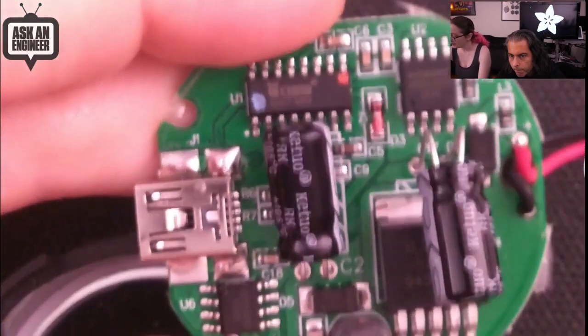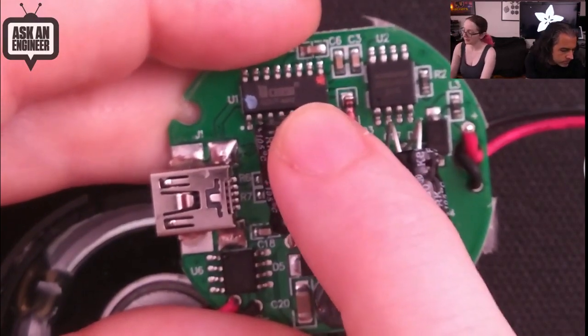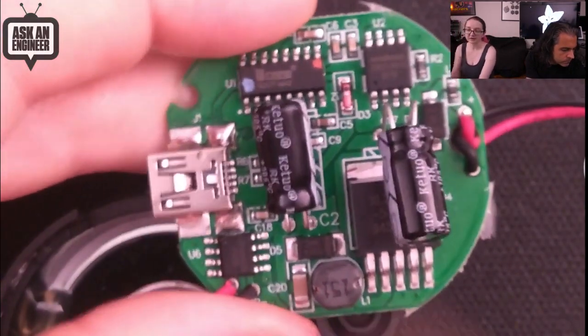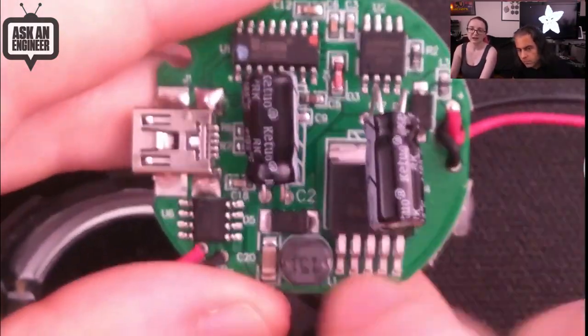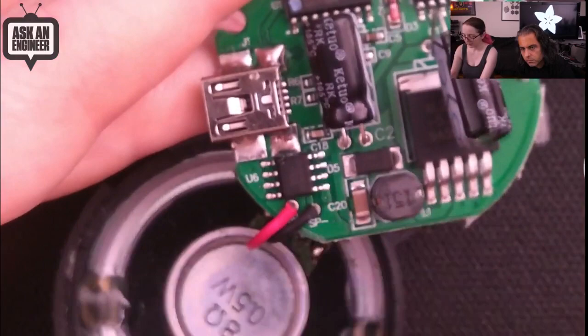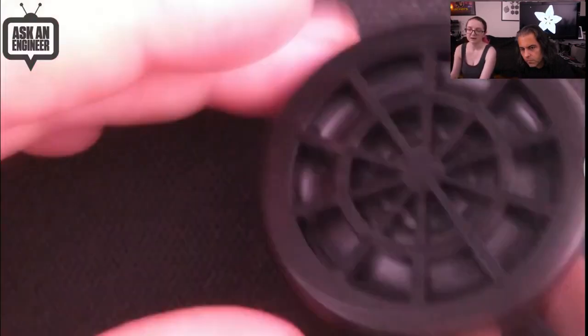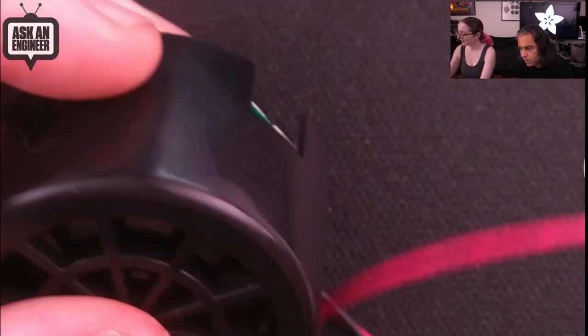The specific parts are: the LM2576 buck converter, the Winbond W25Q32 SPI flash, and the GZUT MA2 — an all-in-one MP3 player chip that handles all the logic. It's all enclosed and glued shut. There's also a little audio amplifier with an output capacitor, and then it goes to a speaker nicely mounted in the case.